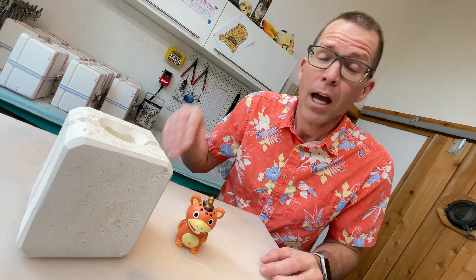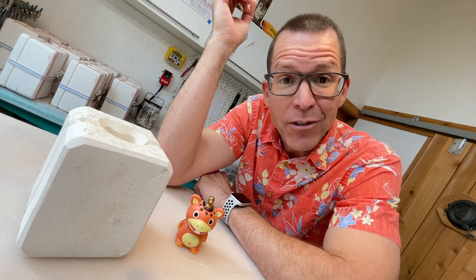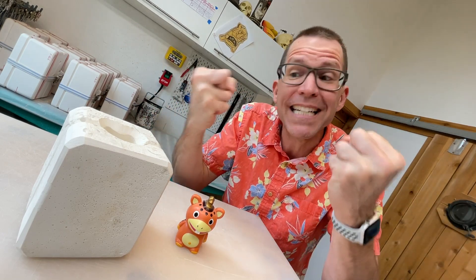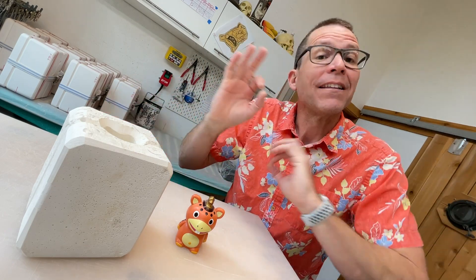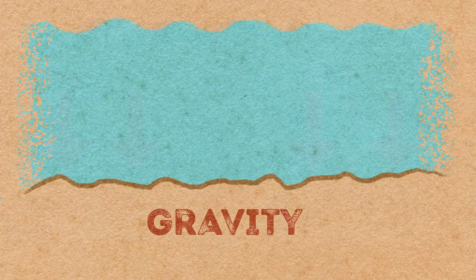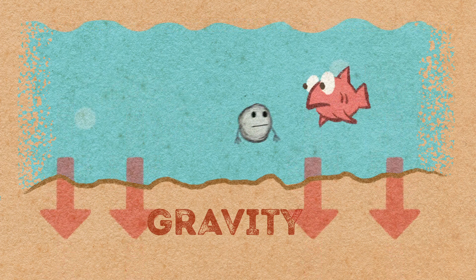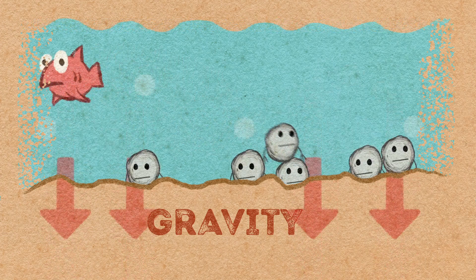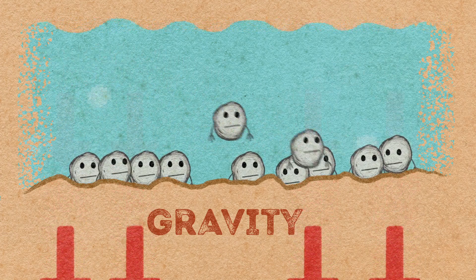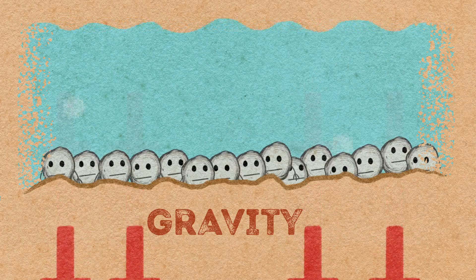I know, maybe you're like, blah blah mold, blah blah slip, this is so technical! But this is Tiki Technical Tuesday, and I'm about to get to the meat of the issue — we're going to talk about how mugs become hollow! The key is, slip casting is a sedimentary process. Imagine water moving along in a stream containing mud and dirt particles — as those particles move through the water, gravity is pulling them to the riverbed. The longer the river flows, the more silt you get on the bottom.